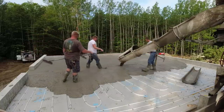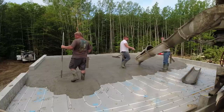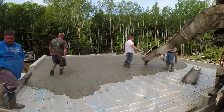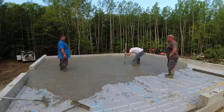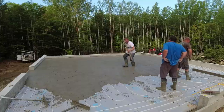And pouring something loose like this, a 6.5, 7 slump with, let's say, a 2 or 3 inch pitch out the front, that doesn't bother this at all. If it was 6 inches of pitch or 7 or 8, then you might not want to pour it quite this loose, but having just like a 2 inch slope, you're not even going to be able to tell.